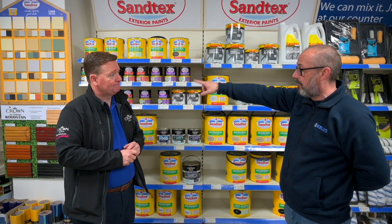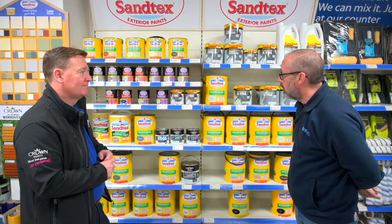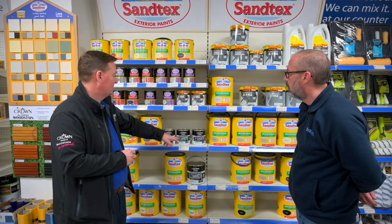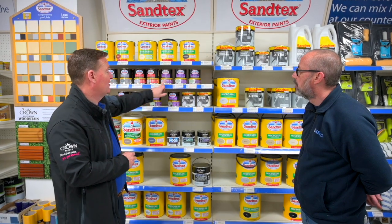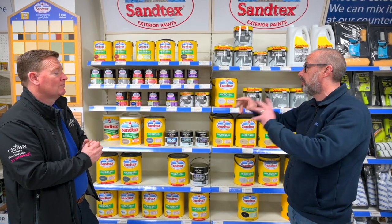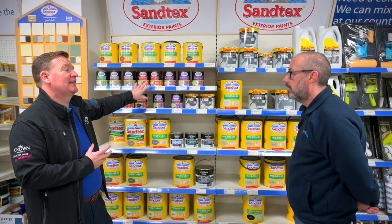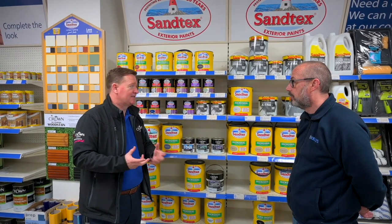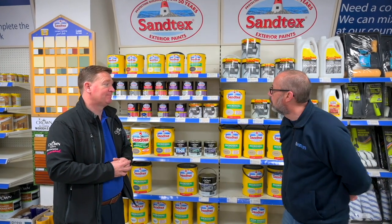For PVC doors, the same rules apply as for the fascia. Paint it with a PVC primer and then go on to either the Fast Flow or the Santex system. So: PVC primer, Fast Flow primer undercoat, and your top coat — or PVC primer, ten-year primer undercoat, and then either your ten-year gloss or ten-year satin. Because a front door is going to expand, contract and flex, you'd be better off with the flexible systems. Anything like that is going to significantly outlast even the Fast Flow or a standard oil-based gloss system — you're looking upwards of ten years before you need to redo it.